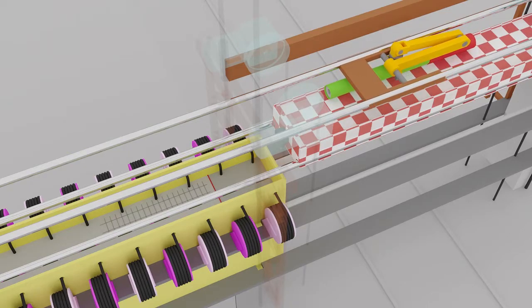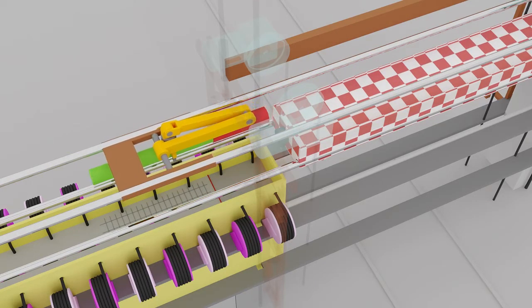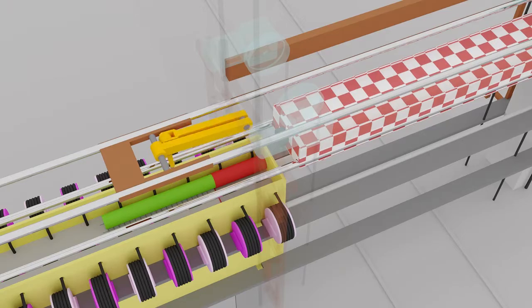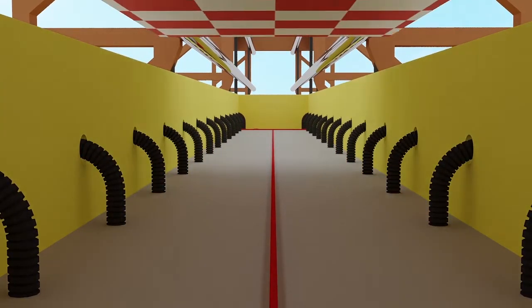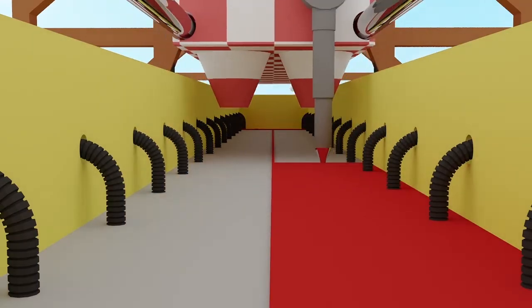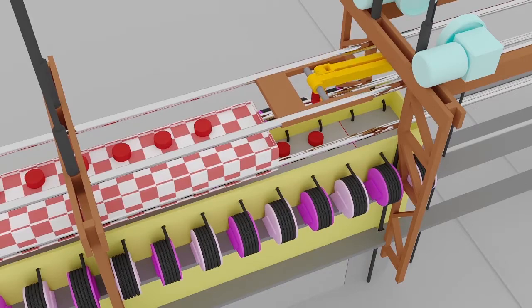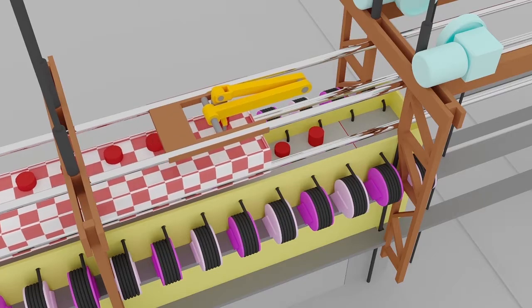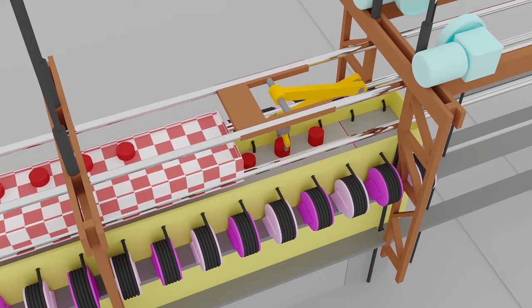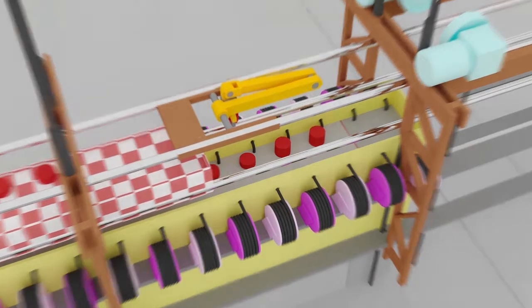The manipulator installs the pivotable swivel hinges in the middle layer of the plate that is currently under formation. The hinges are of a pipe-in-pipe type, allowing for one part of the hinge to be placed inside the column and the second part inside the floor plate. To reduce the weight of the plate and material consumption, the manipulator installs cavity-forming blocks side by side on the top surface of the concrete plate currently being formed. When the next layer of concrete is poured on top, these blocks create voids in the plate.